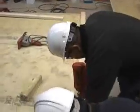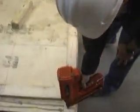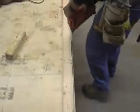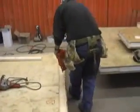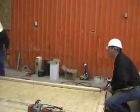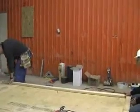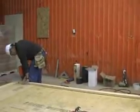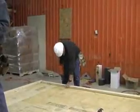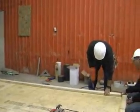If you're a designer, make sure the timber frame is working correctly. You need to tie the panel to the wood — not just have it sitting on the plate. Make sure it's where you want it before you do that. Once we get a wall stabilized, we'll usually build fairly good-sized sections of that wall before we actually tie it to the plate again, because we may want to rack it around a little bit.